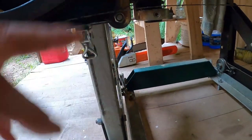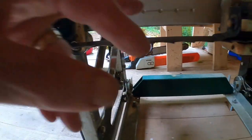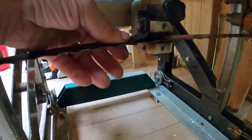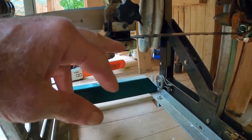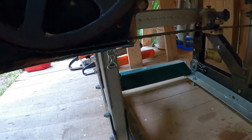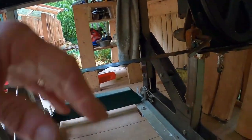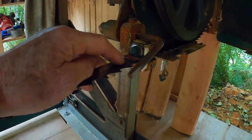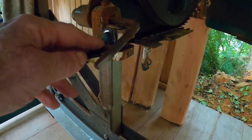When I first got it in there, it was too tight. It wasn't a problem here, but out there it had much more room to work with and it depressed the blade into the bottom guide. So it took some adjustment to get it to the point where the blade guides stay exactly the same 20 thousandths from the blade here as there, yet there's still a little bit of pressure. I shortened the deflector considerably because when it extended further out, it would bump into cans or logs and get pried up. I made it short enough that shouldn't be a problem.